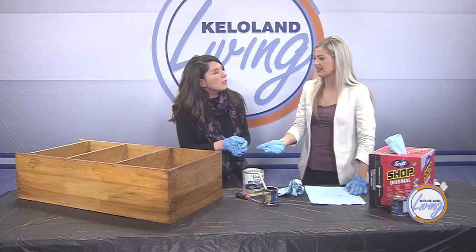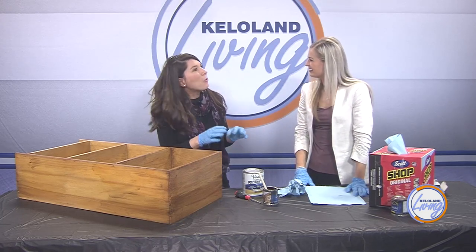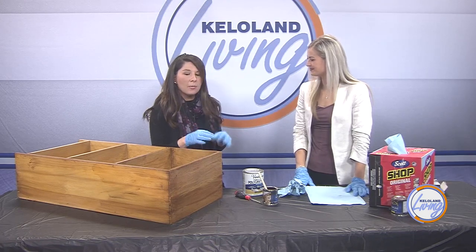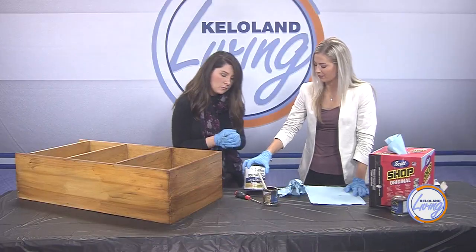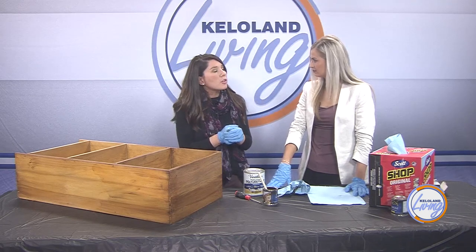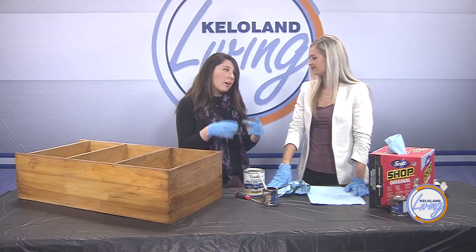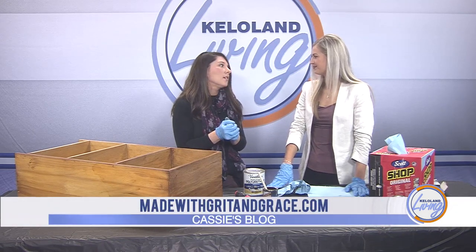Why use this rather than just taking paint? If you talk to anyone experienced with antiques, they cringe if you take a paintbrush to natural or antique wood, because once you put paint on a piece, it's really hard to get it off all the crevices. The advantage here is also not having the traditional stripping process with a lot of chemicals. It preserves the natural rustic look. After applying the final poly coat, let it sit at least 24 hours — and if you can wait longer, a poly can take up to 30 days to fully cure. The longer you wait, the less likely you are to dent or ding it before it's hardened.